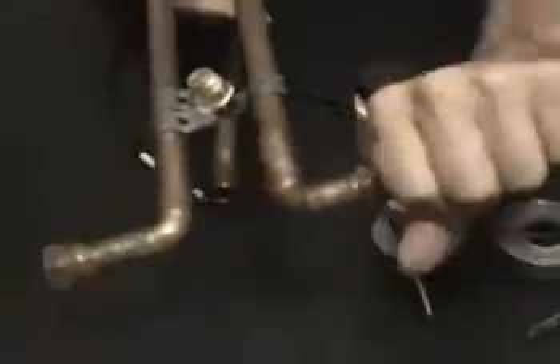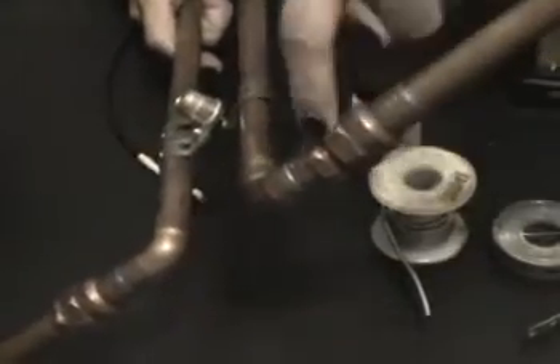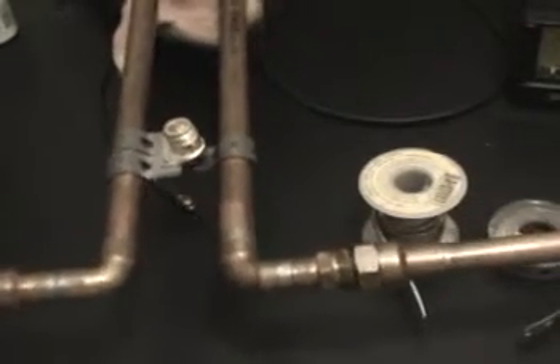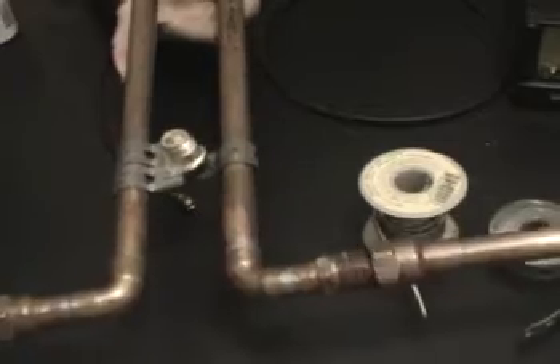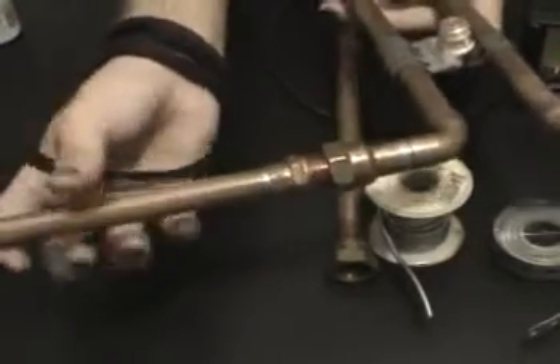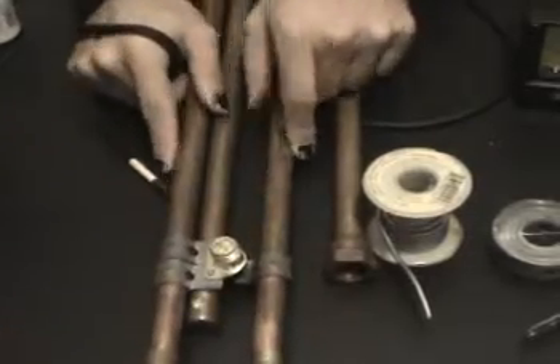The actual threaded fitted adapters, when screwed together, orient so that when it rains, water drips over the threads and off, rather than into the threading. Being that copper will tarnish and can rust if it gets wet, it will eventually turn green much like the Statue of Liberty. So if you plan on leaving this outside, I'd highly recommend coating the entire thing in some kind of non-conductive spray paint. If you have a homeowner's association that gets upset about visible antennas, you can paint it to match the siding of your house and hide it fairly well.